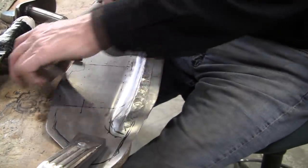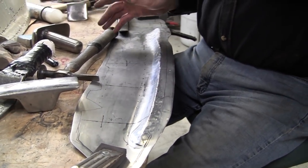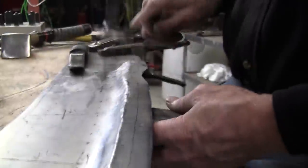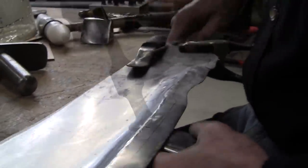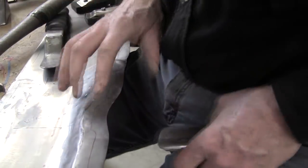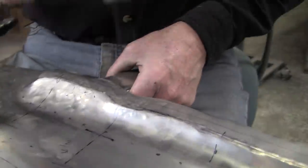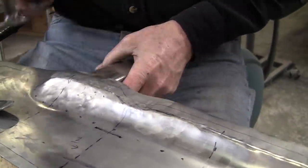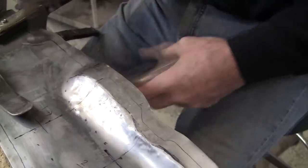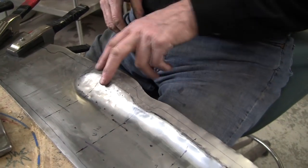If we revert to taking a piece of metal and bending it up like this, and another piece here, and welding this with a MIG welder, you're going to end up with something that's going to need a lot of bondo on it. This will be all planished out nice — we'll shrink and dish this and it'll be perfect. This has to be down a little bit right here, so I have to knock that down. I might have to use a little heat over here. So that roughed it out — we've got to planish that a little bit. I need a round hammer to get that.